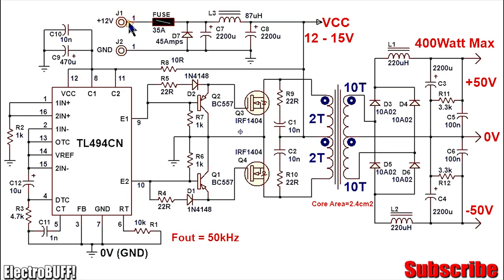At the inputs you have your 12 volts. There's a fuse for short circuit or overcurrent protection rated at about 5 amperes. Diode D7 is for reverse polarity protection — when you connect the power supply in reverse it will short circuit the fuse, which will blow and cut off current flow to the rest of the circuit. C7, C8, and L3 form a pi filter and this will smooth the input power supply in case there is input noise.